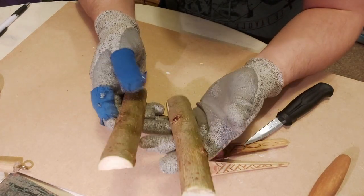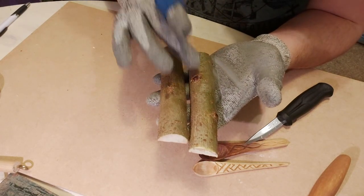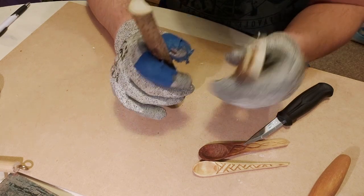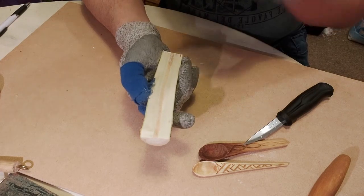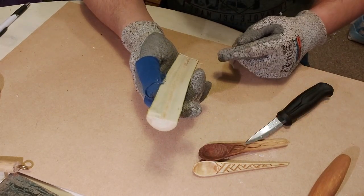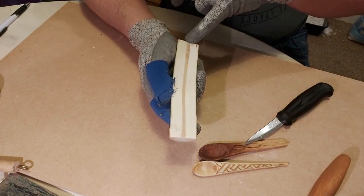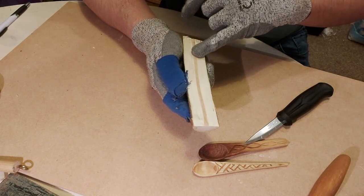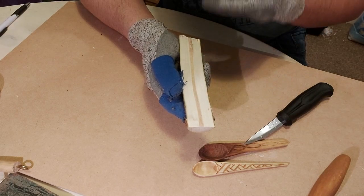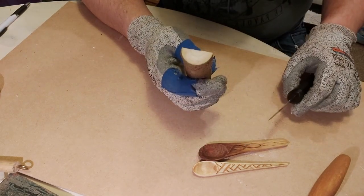The first thing to do is choose which part of the wood to use. Look at which piece has the most knots, because knots are a pain to carve through. This one has only got one knot, while this one has a couple and also a big split at the end where the wood cracked, so I'm going to leave that to one side. Depending on the spoon you're making, you can follow the curvature of the wood. Then the first thing to do is get rid of the pith in the middle — that soft, pulpy stuff that sends the sap through the wood. As it dries it'll be spongy and flaky and will let moisture and air in, causing it to crack.